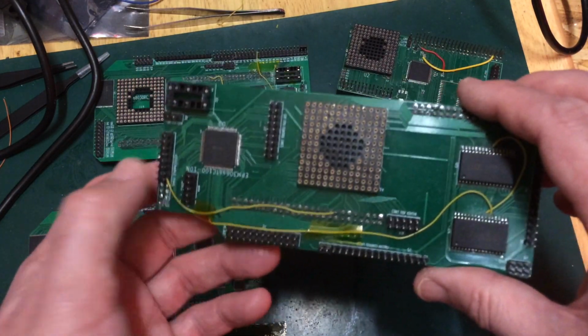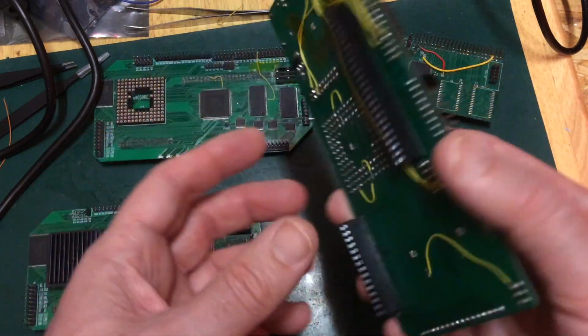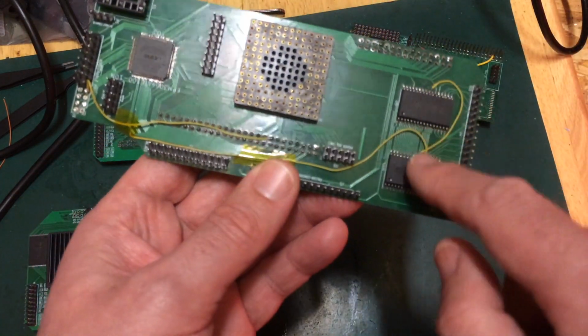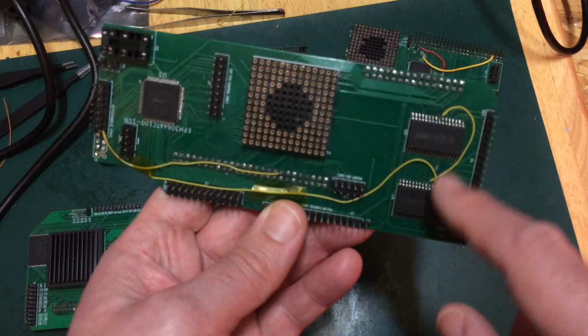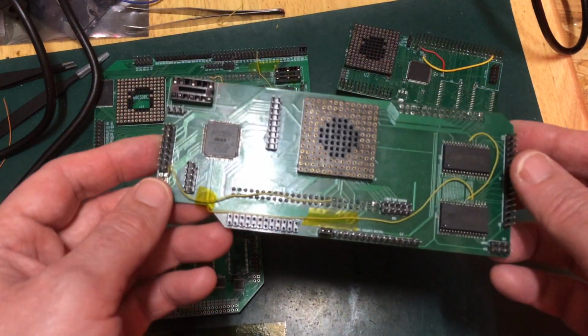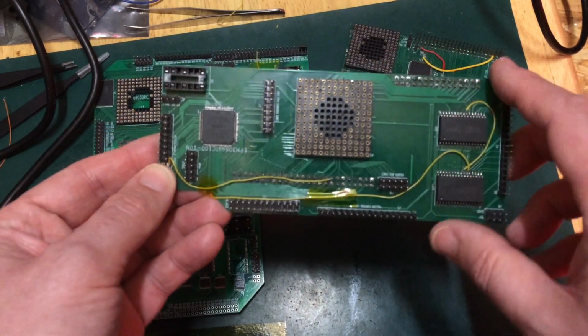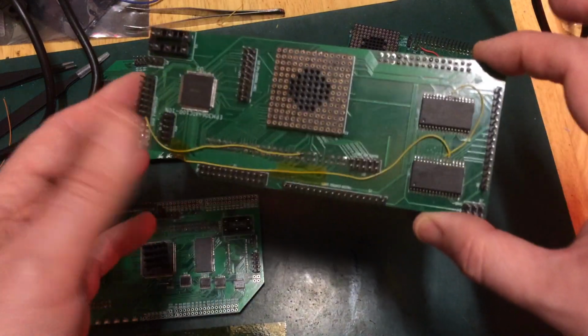We got acceleration, we got it running at 50 megahertz, and we got some SRAM. This one was actually only 16 bits, these are 8 bits of SRAM each, so this was only a 16-bit bus, but again, it was just to prove the case. So it wasn't particularly fast, wasn't as fast as it's ever going to be, but again, we proved that Alt-RAM could be brought online happily with a board of this form factor.